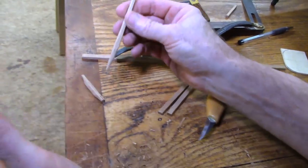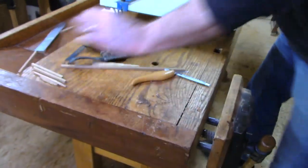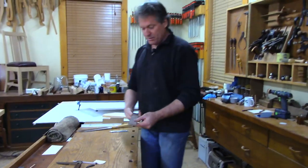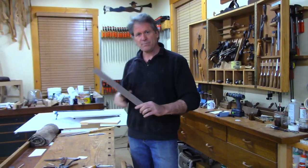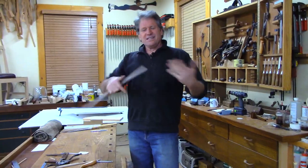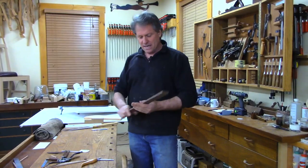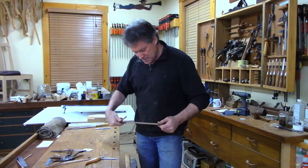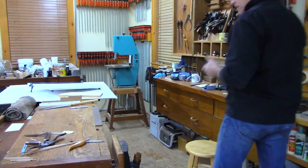I went ahead and got the other legs all shaped up, which I'll show in a few minutes. But let's work on the seat. The seat will come out of the walnut. This is one of the things I really wanted to get a feel for — the shape, and getting that Wharton Esherick look where it almost looks like paper draped over something, getting thin at the edge. I won't be dead-on that, but I made this template from my scale drawing. I'll clamp the stock to the bench, step in the template, and take a carving chisel to dish it out.